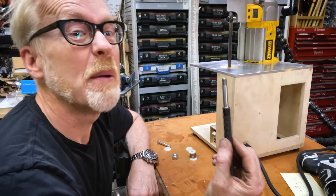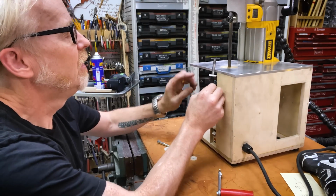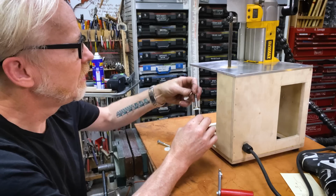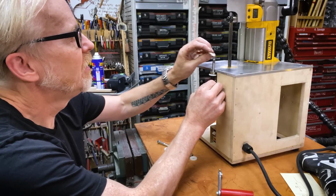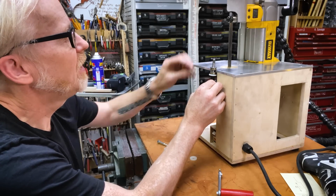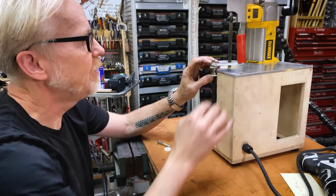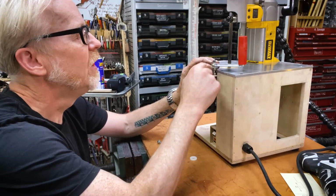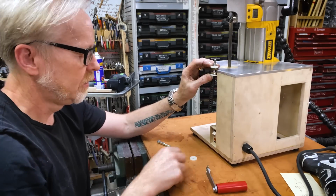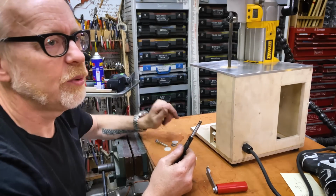All right, so I've got my part turned down. It's time to just double check my measurements. I'm gonna have a nylon bearing there on the underside. Then we do thrust bearing. Thrust bearing butts right up to the table. Second thrust bearing butts right up to the table. It's chased by another nylon bearing. That way we have a little bit of softness holding it all together. And the crank comes on top of that. Yep, and a nylock nut there. So in order to have a keeper for this guy, I'm gonna mill a flat on the right here. And then we should, once I drill a hole in here, be ready to install.